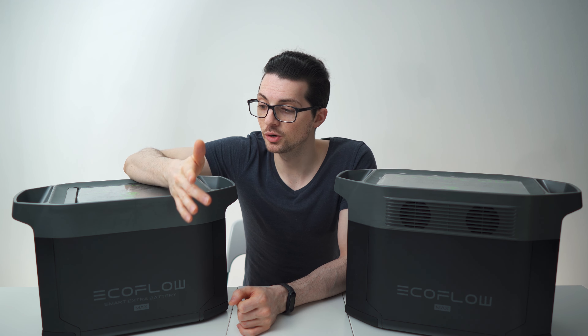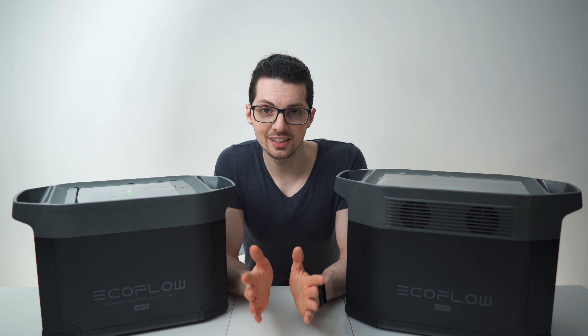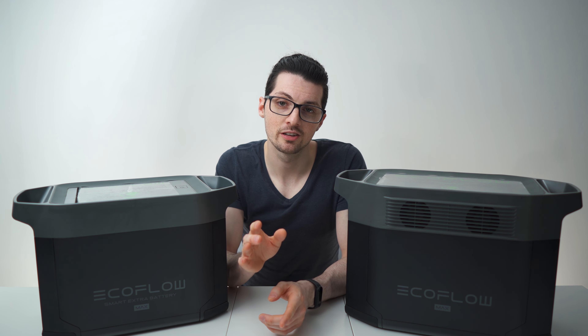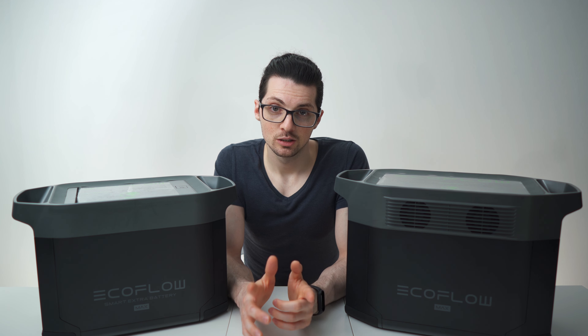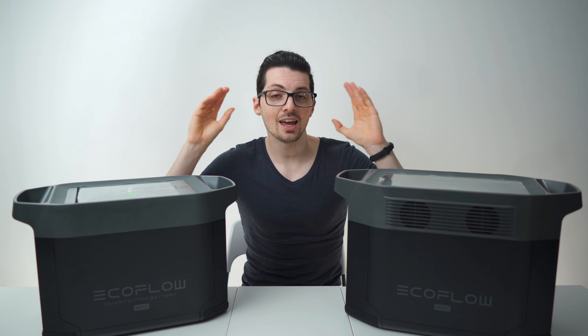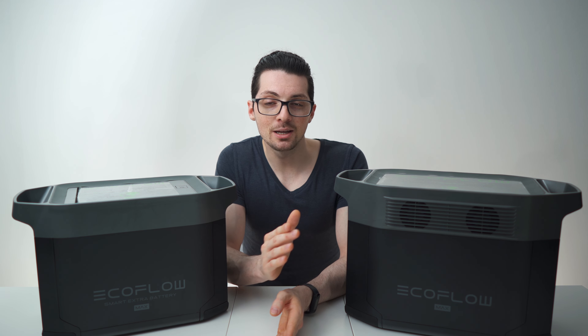In this video I will explain, test, and demonstrate all the functionalities and features, and we'll check out the fully fledged autonomous system I've built with my dad — a DIY 70 kilowatt-hour battery built with second-life cells, and a 10, actually 12 kilowatt rooftop installation with off-grid and grid-parallel functionalities. Then we'll try to scale this down to create a fully autonomous system in my flat, complete with a balcony power station to last at least two to five days of power outage even with bad weather.